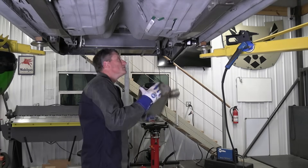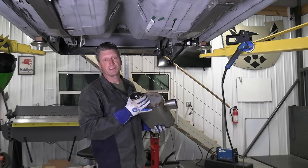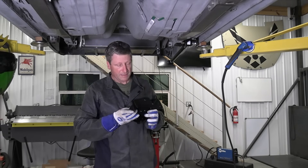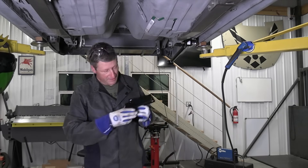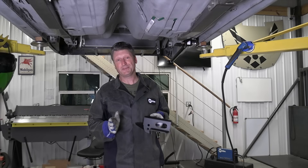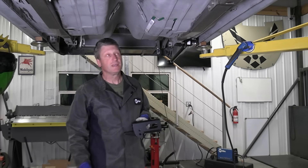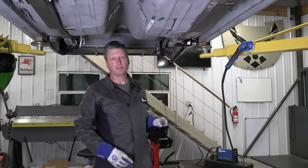My plan was to use the original pocket to mount these custom Billy Boat mufflers, but I need to make an adjustment — they need to be moved forward about four inches. That's because I decided to use these heavy-duty four-link mounts from Detroit Speed instead of the stock leaf spring mount or making my own. These are definitely the easy button, but they have an additional mounting hole which lowers the total length of the mount by another inch and a quarter, putting it right in the way of my outlet port. My options are either lower the muffler, which I don't want to do, or slide it forward. I'm already cutting some of the foot pan out for inlet tube clearance, so I'll just make the back part a little wider to accommodate the muffler.